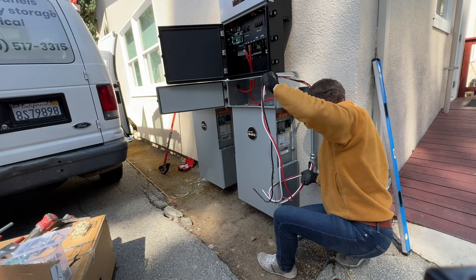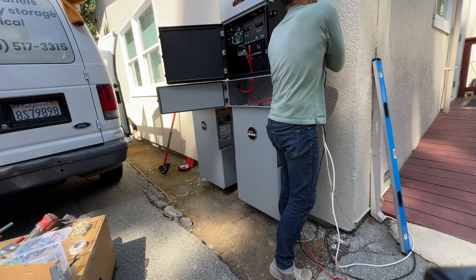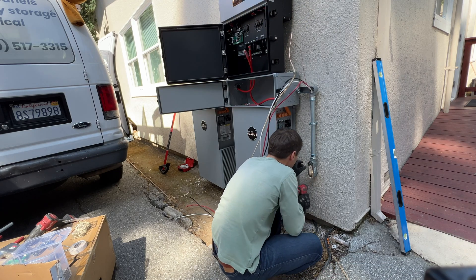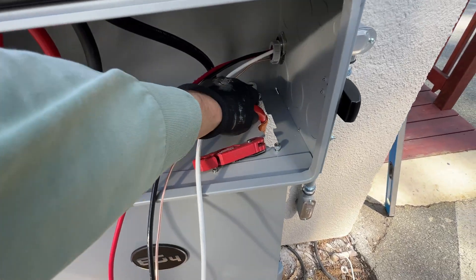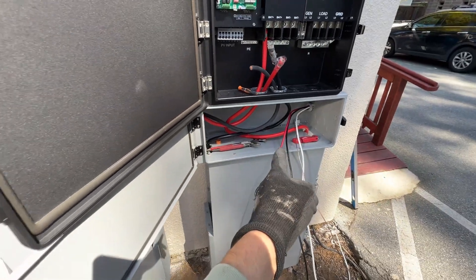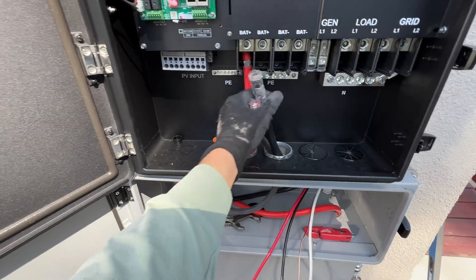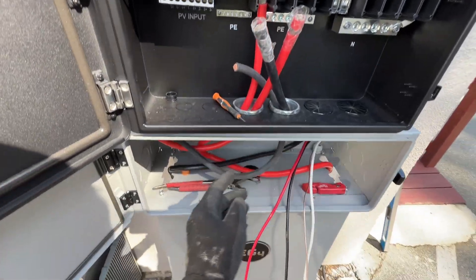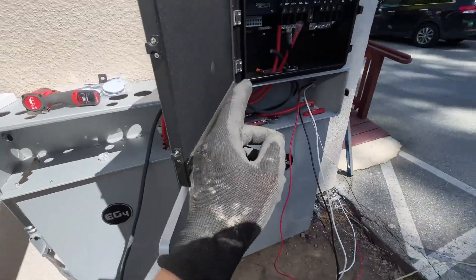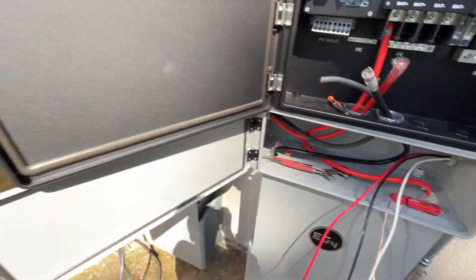After finishing all conduits we can run wires from the crawl space into the inverter. For the battery wires I'm going to use the ones that came with the batteries — the length is good enough, and I can reach the positive from this battery to the positive on this side. The negative will go from this battery; however, the standard negative from this side will not reach the inverter, so I'm just going to crimp another wire for this battery.